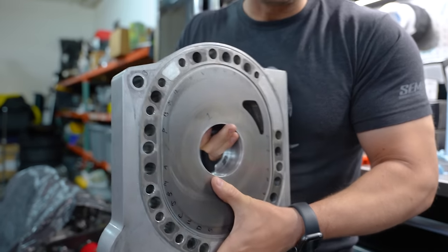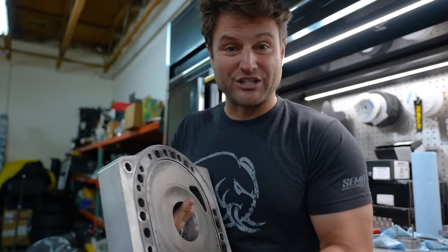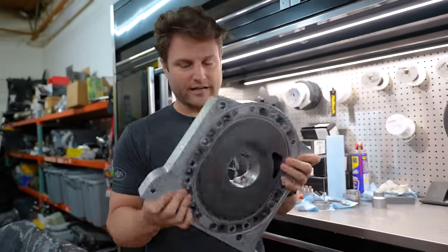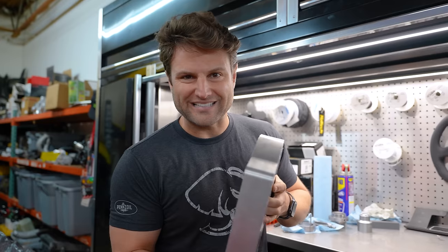86-10-4 is actually used in a lot of aerospace applications, and you can find a lot of documents documenting exactly how it's put onto aluminum 7075. So there's a lot of information about what we're about to do. A couple different interesting things. One is that yes, this piece is still kind of heavy, which that's fine, that's not that big of a deal, but there's unnecessary material in it.